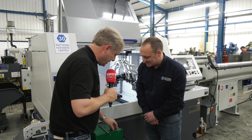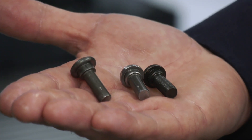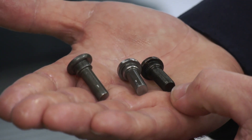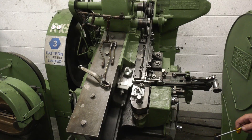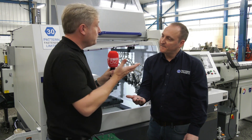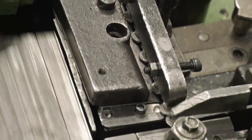So parts - just here, these are on the old machines. I'd like to showcase what you're actually doing here. Yeah so our legacy business is machining forged parts, so here's an example of a forged fastener, a blank - we machine it on an old plugboard lathe which is manually loaded, then we do thread rolling, knurling, that type of thing, so they're all separate processes. Still doing it and still serving our customers with that old kit. Some of it dates back to the 40s? Yes absolutely, we've got some very old kit but it's very good at what it does and we just leave it that way.